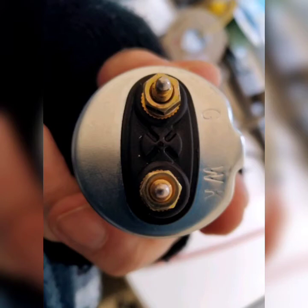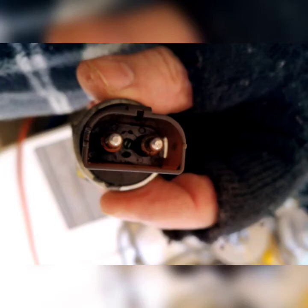So we will have to connect on to a new set of sensors, and this may require a new set of fittings. This is the old Volvo Penta sensor with two push-on bullet fittings, and as you could see, the temperature was spade fittings and the oil pressure was ring fittings, so we would need to change the wiring to accommodate the new temperature and oil pressure sensors. As you can also see, it was very cold, so I needed my finger gloves on. You do need to be able to protect your hands if you can, but you also need manual dexterity, so please be safe when you're working.